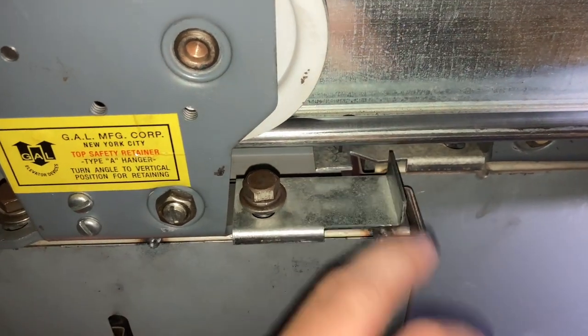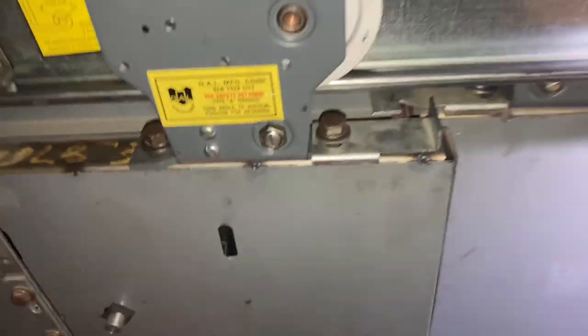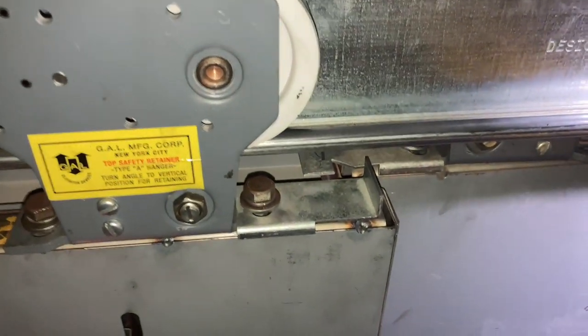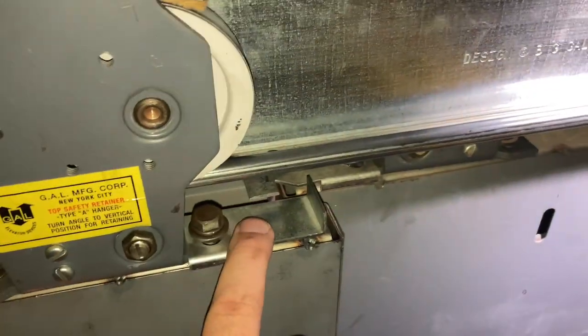Something was damaged on these doors and they became separated. The fast door is going to whip closed, and this will catch it, which closes the slow door — so you'd never have the door locked with this door stuck back there creating an opening into the hoistway. They weren't aligned very well, so if needed, it wouldn't work. Also, this is loose up on that door, which I have to go address as well.